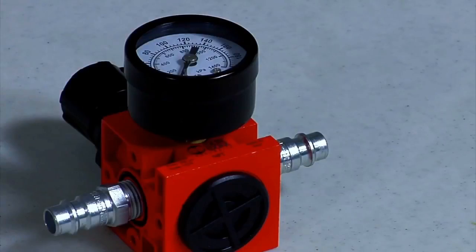Today we're going to show that by using our air regulator kit we can reduce the amount of compressed air needed by 50%. A regulator kit set between 40 to 60 psi should be installed in front of every air amplifier used.